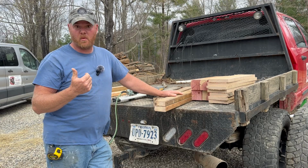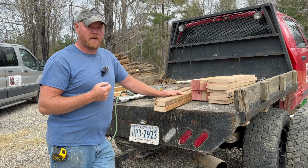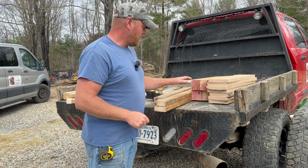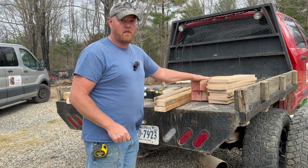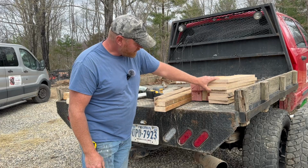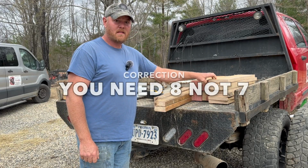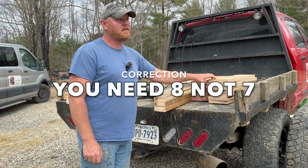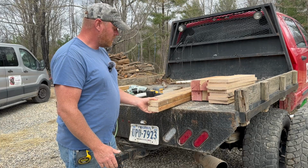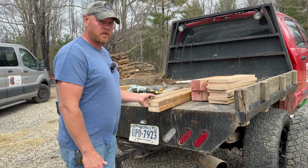And in fact, I just had the boys who are behind the camera cut the materials for me while I was eating my lunch. So anyway, you're gonna need four 22-inch 2x4s or 4x4s. I think I've got seven 1x6s, 22 inches, 27 inches long, so they overhang a little bit. I've got two 48-inch long 2x4s, two 24-inch long 2x4s.